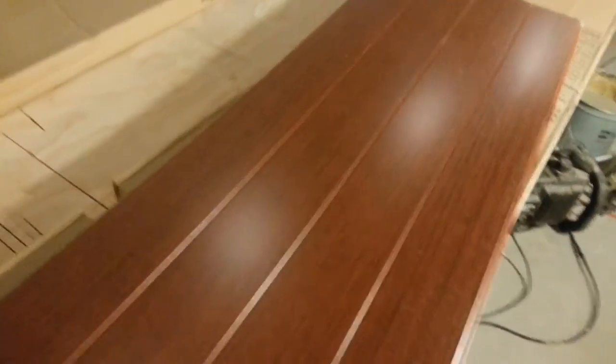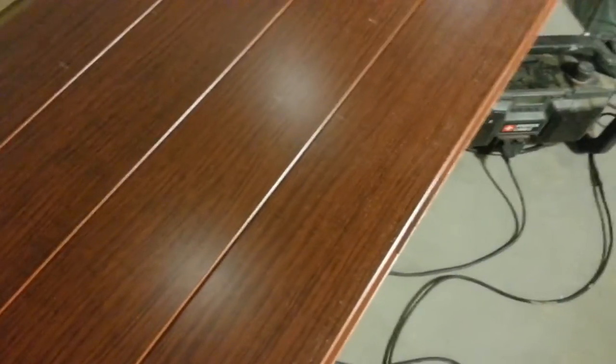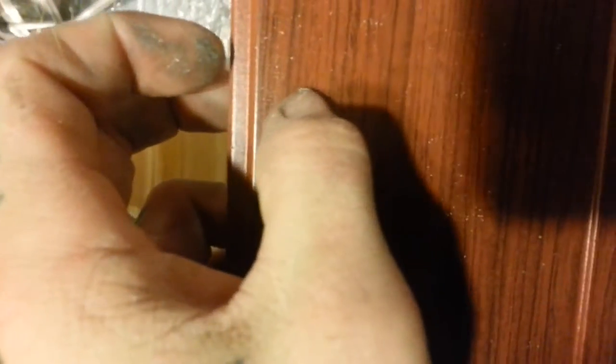So now you're gonna take your plank, and this is your face right here, right? It's pretty nice. Now when you start off of an inside corner, you don't want to put this male end in the inside corner, because since it's so big, it'll have like a divot, if you know what I mean. The inside corner, there'll be like a void.